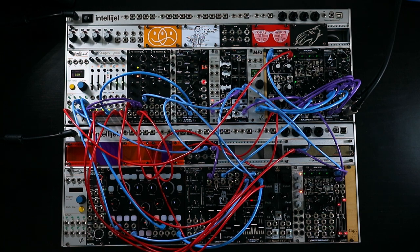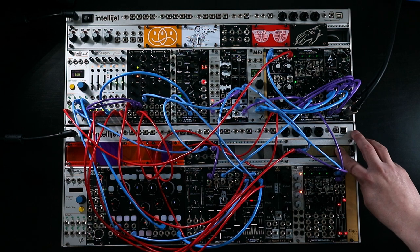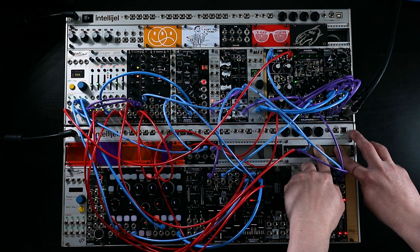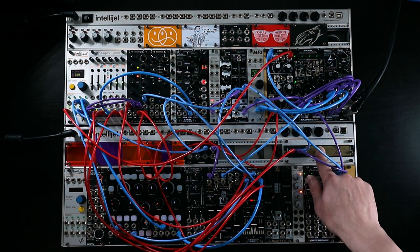Probably the big one is that with hot audio rate signals, there is leakage to adjacent zones. You may have heard it on one or two of the demos. I suspect this is because of the spiral areas allowing a current to be induced because of the proximity of the two tracks, but I'm no electrical engineer, so that's just a guess. Just know that in that use case, you might find that you don't have perfect isolation between zones. The isolation between the top and bottom zones seems much better though.